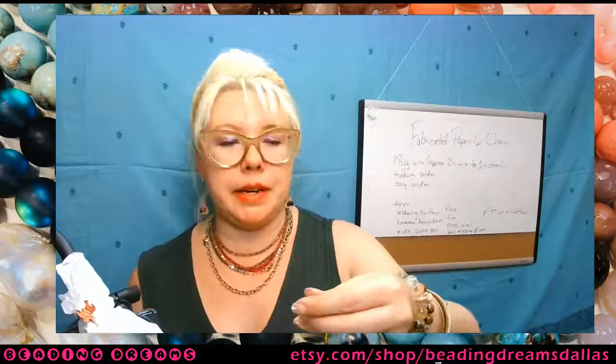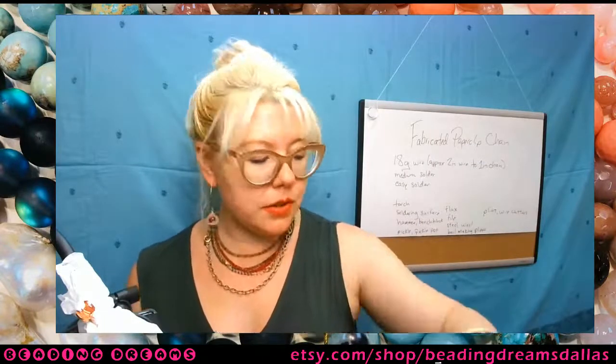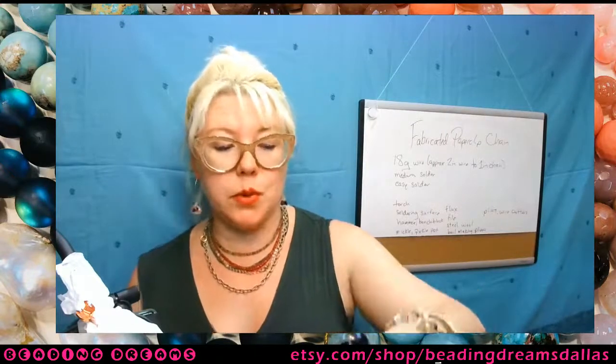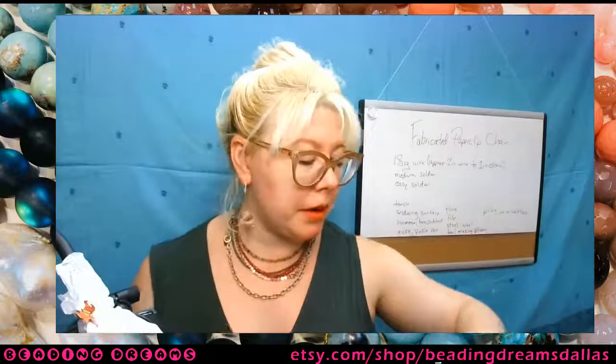And I just mean these are things that come up again and again. So number one, try your best to have 6 to 8 inches of clear space around your soldering area. That means 6 to 8 inches of space where there's nothing flammable or meltable. This is, of course, a do as I say, not as I do moment, because I have cameras and lights right here, all up on my soldering surface.